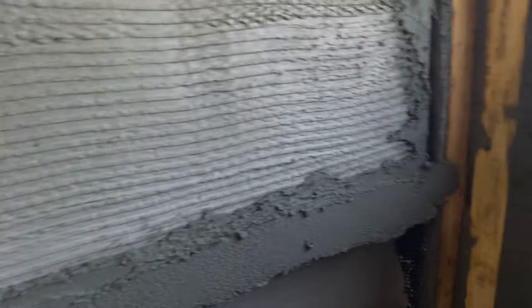So I'm going to cut this wall. Eddie's making one last bucket of mud, fill this in. We'll cut it, let it set up a little bit, grab something to drink, and then pop these sticks and finish cutting all the other little parts of it. So we got a little bit up there too. I didn't want to do anything up there because of how it is on the ceiling, it's real hard to push it into a lath up top. So let that set up a little bit more because I don't want to start cutting and have it pull out on me. So similar to the valves down here, we'll just let that set up, be one of the last things that we cut, and then we are good to go.